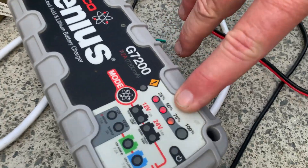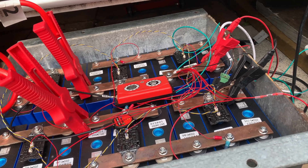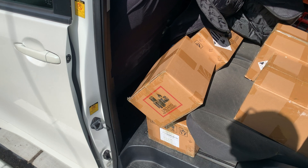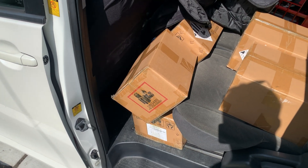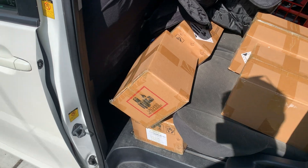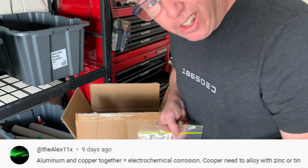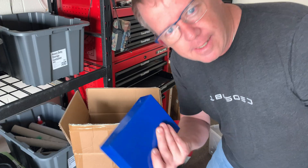It's at 75 percent and I'm just charging those four cells, the jumper cable is just to bridge those two. The battery I built last week - badly, according to the internet - we're pulling apart and putting in different batteries. We're going to take out the EVE cells and put in GFB cells. We've also got some different bus bars to try and address the issue with galvanic corrosion - that's a new thing I had to Google. New nuts and new batteries too.